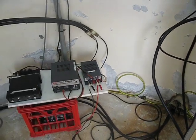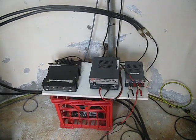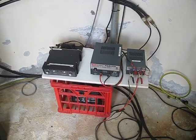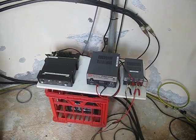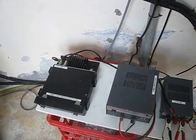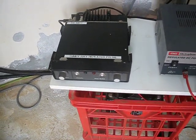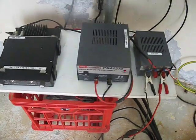Also on the side here is a UHF CB repeater on channel 8. For those unfamiliar: in Australia we have an 80-channel allocation in the UHF band, 476 to 477 MHz, with 12.5 kHz channel spacing. This repeater transmits on channel 8 and receives on channel 38. That unit there is an old FM828 — a UHF version, a bit later than the VHF model. You can also see a battery, power supply, and changeover equipment.